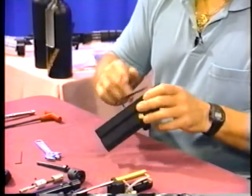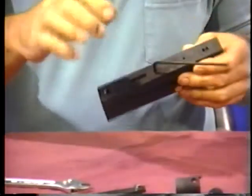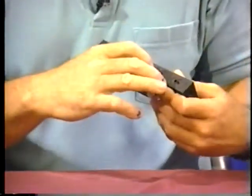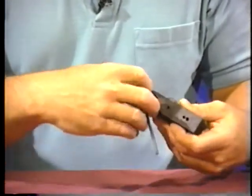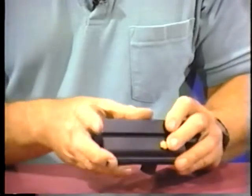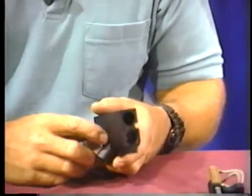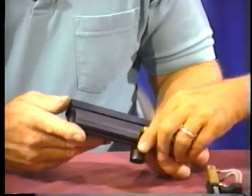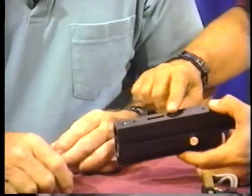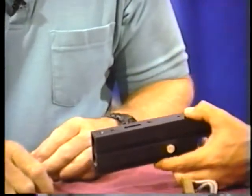You make sure that it's below the surface of the gun. And you don't have to snug it. It's a plug. You could just barely finger tighten it. Because if you tighten it too much, you're going to push on the side of the valve guide assembly, and the valve will start leaking right off the bat. It's important to get that screw all the way in, otherwise the trigger is going to drag across that Allen. So make sure it's just below the surface of the body.